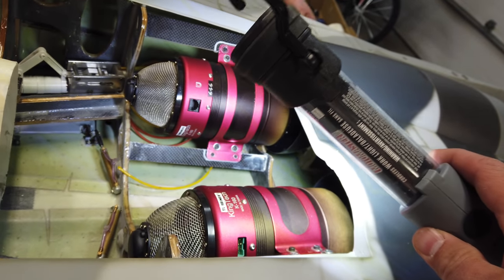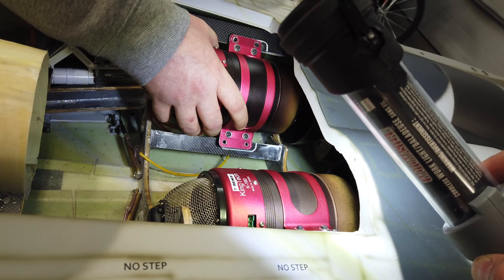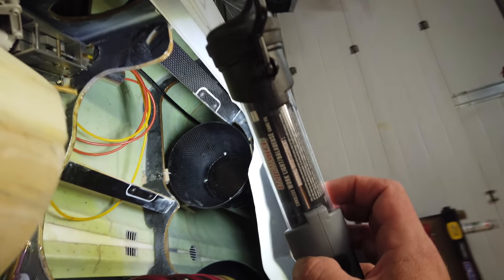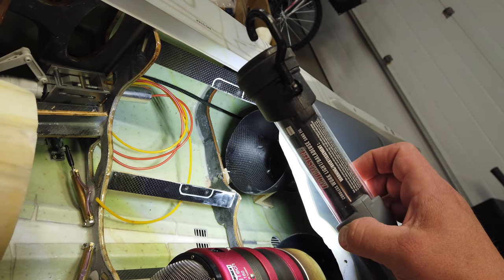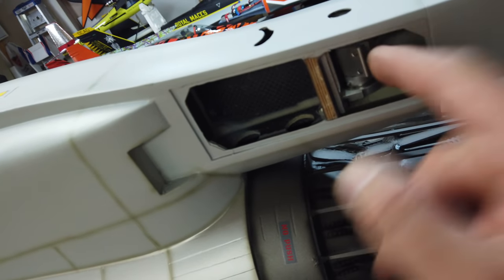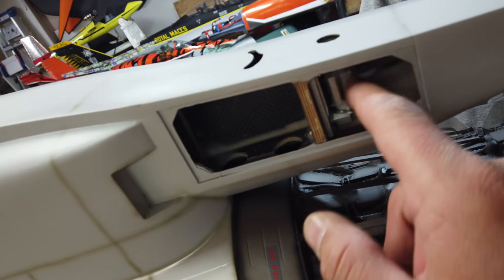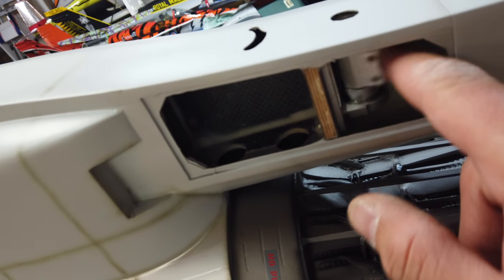Working on the pipe mounting — if you look right below the turbine, you can see the wooden block we were talking about. We've got one mounted on the top side of the aircraft at the carbon bell mouth and one on the bottom. Now that the pipes are nicely centered, we're going to drill through the carbon into the half-inch wood block and that will be our pipe mounting. Also, a couple of tips: the bearings were very, very dry, so we put a little bit of bearing lube on them and it made a huge difference — they're actually rotating instead of grinding. They've got metal seals; you can just put lube on the seal itself and it works its way in. We did that to both and they work much better.